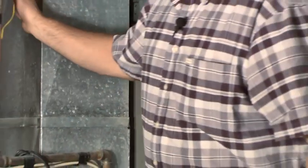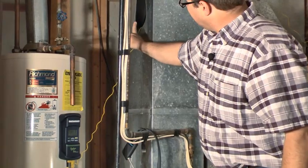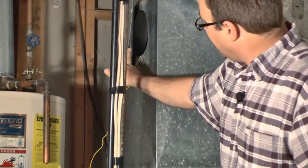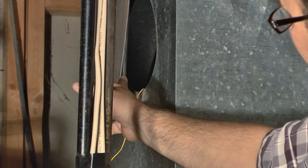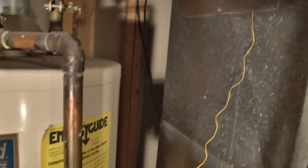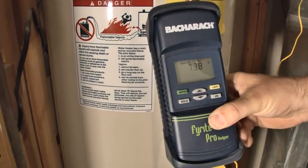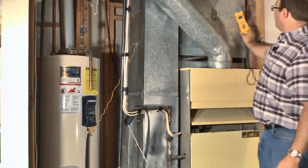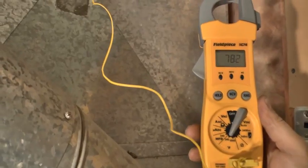In this case, there's a nice piece of metal here where at one time some ductwork was tied to this — maybe a humidifier, I'm not sure. I'll just put my probe in there and get my temperature reading using my combustion analyzer with that one, and my temperature reading using my multimeter with this one.